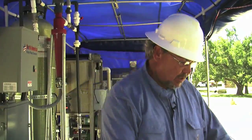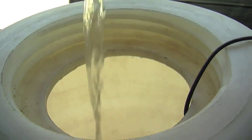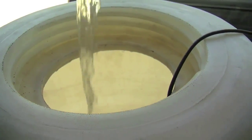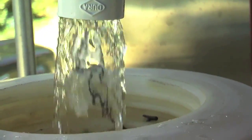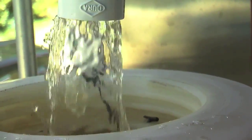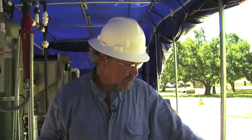Following the water coming out of the level master, this water will go into our bulk storage container. At this point the water is about 10,000 parts per million FOG — free oil and greases — and has a high particulate of TSS suspended solids. You'll see that the water is dirty but far cleaner and free of most of the oil than it was at the beginning.